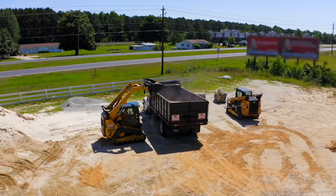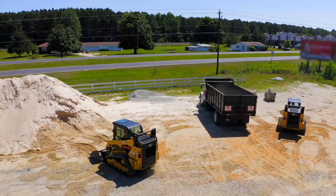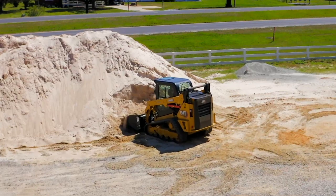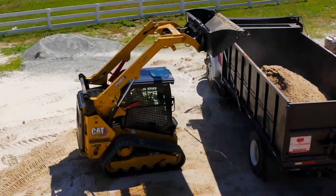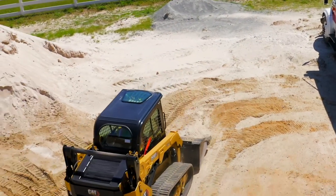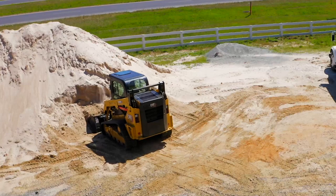The return to dig can be used when you're doing a V or a Y cycle — loading material from a pile and then carrying it to a truck. You'd scoop material into your bucket, back away from the pile, go over to the truck, dump into the truck, and then as you're clearing the sideboards and backing away, you'd be lowering and returning the bucket to a position ready to attack the pile again. The return to dig feature automates this and makes it much easier.